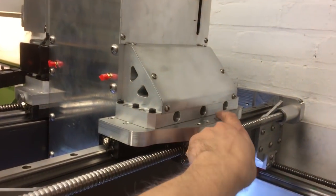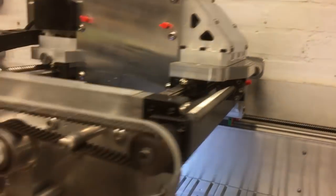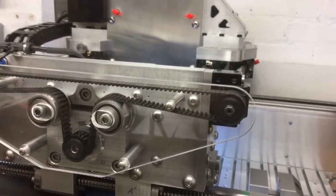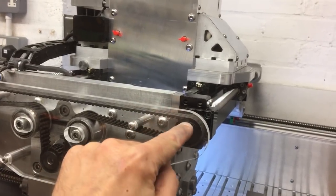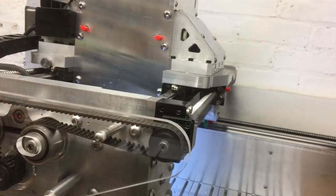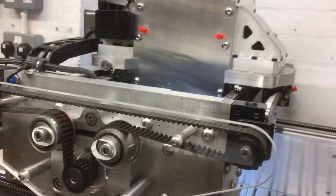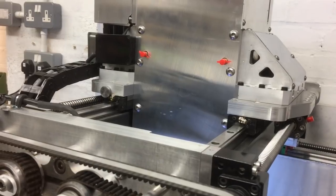On the Y axis I had provisioned extra holes for a pair of preloaded ball screws on each side, but I decided against it because a single motor driving both with extra friction on all that moving mass was impractical. Instead, the backlash approach was to rotationally preload the balls on one ball nut against the other, then lock it on the shaft — so there's built-in rotational tension between the two ball screws. When moving one way it pushes harder on one screw; coming back the other way, vice versa. DTI tests show the backlash is pretty small, so I'd definitely do that again as well.